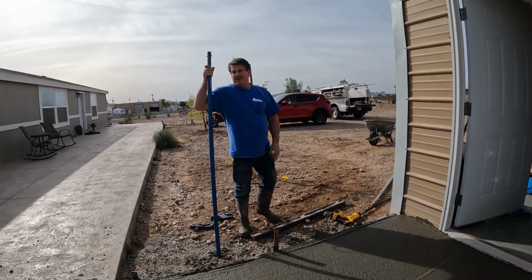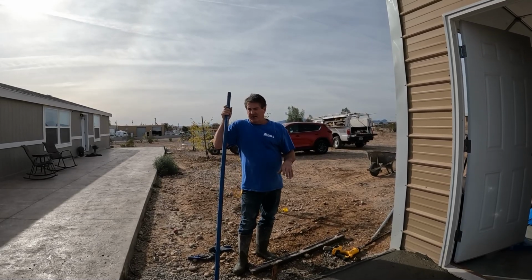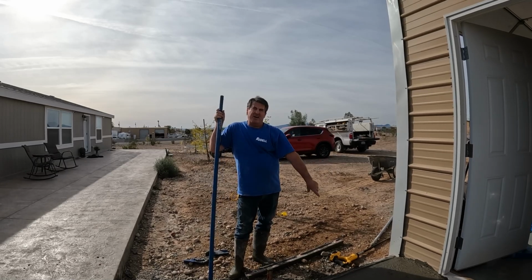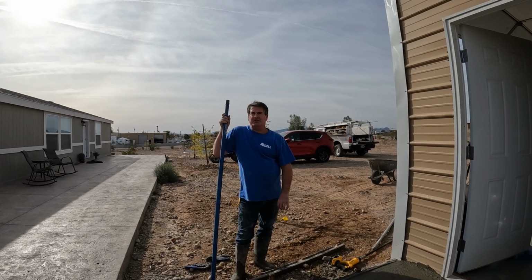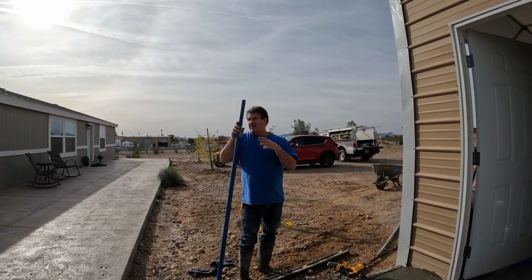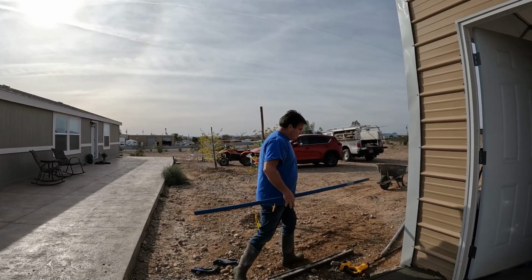So far what we've done here, we got the concrete in the hole, we've rodded it off, or screeded it, we vibrated the entire edge, consolidate the concrete, and get rid of the rock pockets when we strip. Now we've hit it with the 3-foot wood bull float. Now I'm going to the 4-foot magnesium bull float.